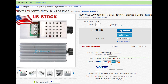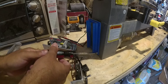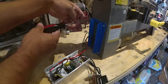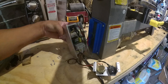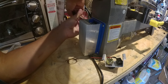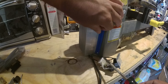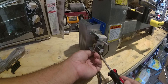That's the 3D printed piece that goes onto that guy, right there. I tried to get everything to mount to the original holes — I didn't want to tap any holes into that cast iron lathe, so I just kind of made everything to fit that. I designed that blue plastic mount — it's 3D printed to fit that SCR. And you just screw it back in on the sides. The original controller spun a little bit too fast, and I didn't want to go through the trouble of figuring out how to make it spin at a slow rate.